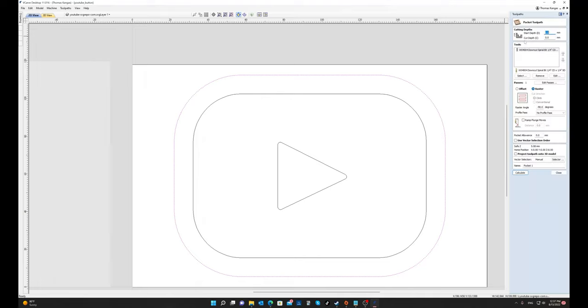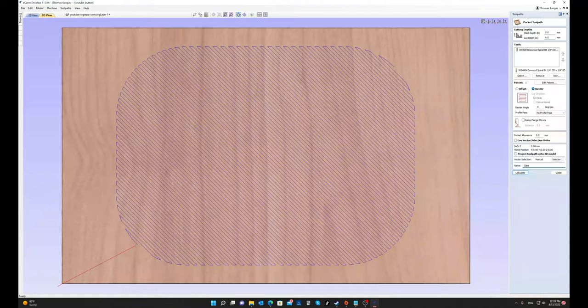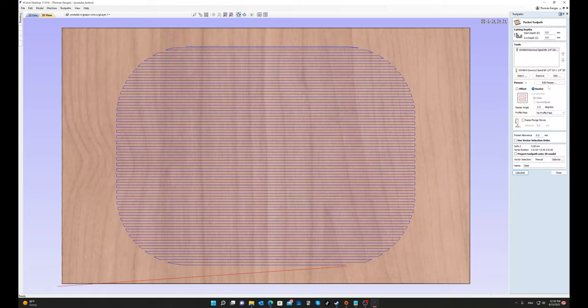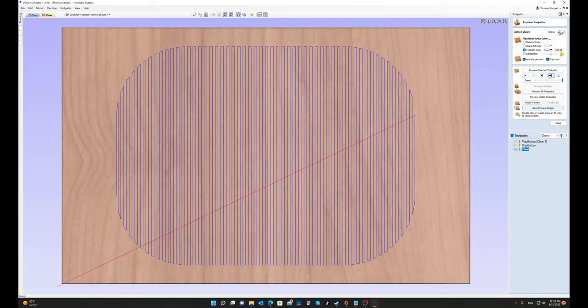Now, the trick I use to do my clearance is that I'll set both a start and flat depth of 0. Then, when I export the job, I'll set my Z offset to the top of the workpiece and execute the job. This will glide across the top of the workpiece without taking off any of the top layer of the piece, but clearing all the material. Only do this if your CNC is capable of cutting the thickness of the excess material you have at the top.